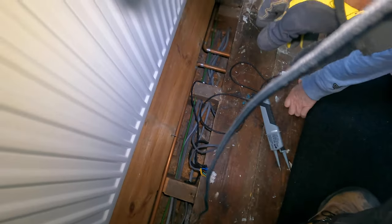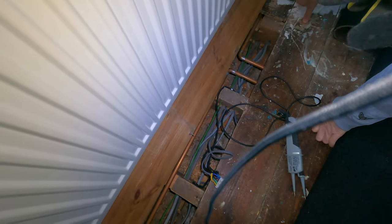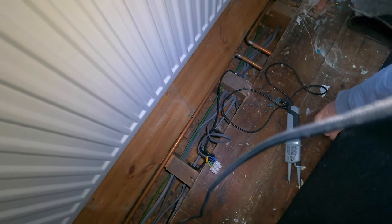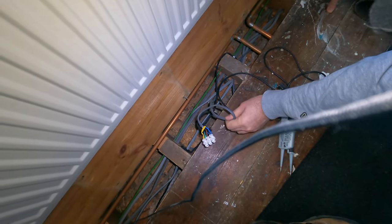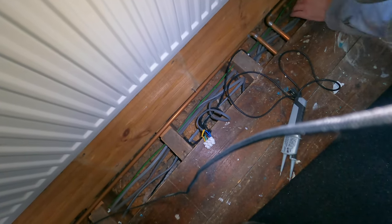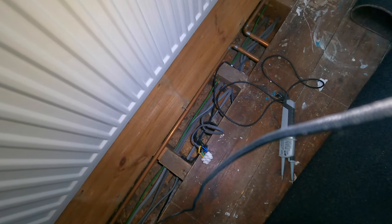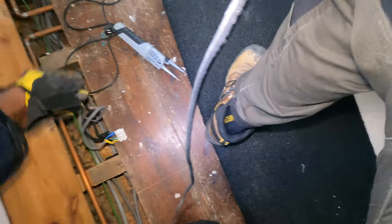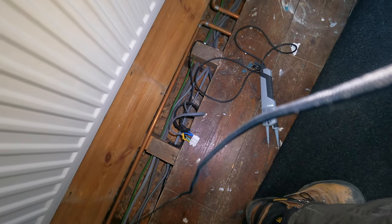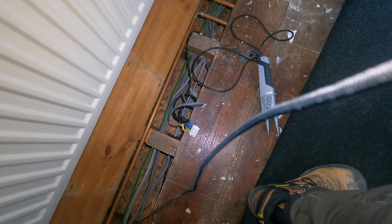See this cable here? It goes that way. Where does it go? I need to get this up. They've probably pulled it from somewhere in the hallway or somewhere like that. Which is the cable again? Oh, that's the one bringing the power in. There's a junction somewhere — because it goes down to the switch, and it must pick up the neutral from somewhere. The journey for that cable is from wherever it's connected — that's where we want to see, that first connection — to solve the problem. It may not even be there, maybe somewhere else, but we need to see that first. Which means lifting floorboards up in the hallway.